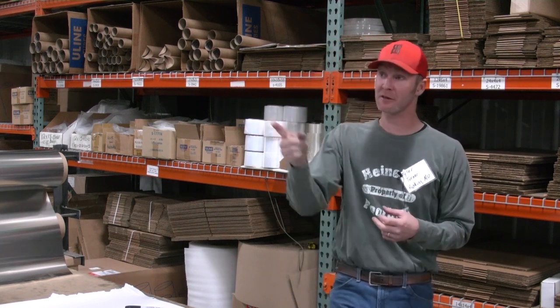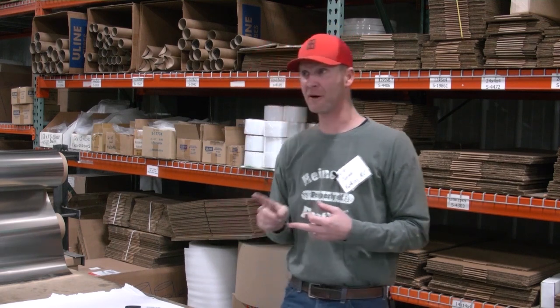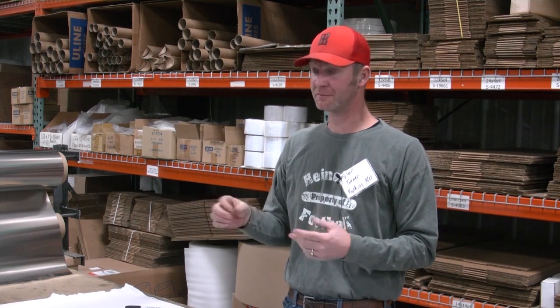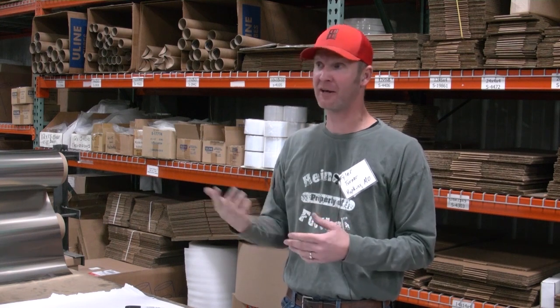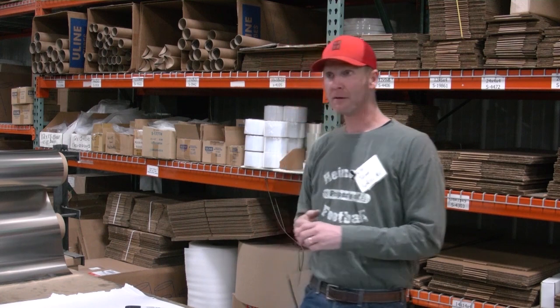Do you use thread forming taps or thread cutting taps? I use thread forming taps. With a thread forming tap, you need to go down to a 47. But with a standard plug tap, use a number 48. I recently just got a tapping machine, but I tapped everything until now by hand. No fixtures, just free-handed. What kind of tapping machine did you get?